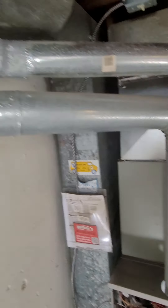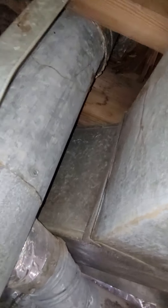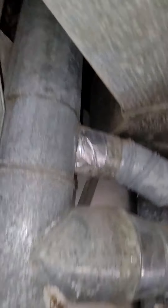Flue — you got a four, three on the water heater, into a five going up. I put five — that might be a six. Flue liner up there.